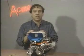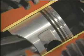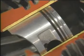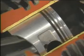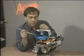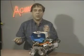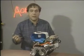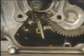A car engine is a lot like this one, except that it has multiple pistons that share a common crank. These things are the famous piston rings. They're made from springy metal and expand outwards to form a good seal between the piston and the walls of the cylinder. The bottom ring prevents oil from creeping up into the combustion chamber. Without being well lubricated, an engine will just turn itself into scrap rapidly. This engine uses a splash method to oil all the parts — the bottom's full of oil and a finger on the crank throws it around. Some engines, like the one in a car, use a pump to distribute the oil.